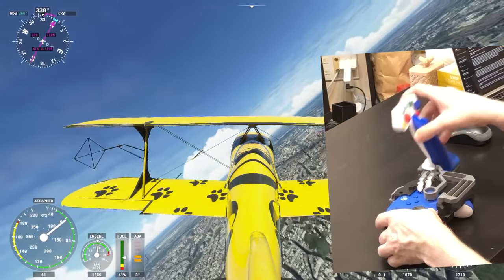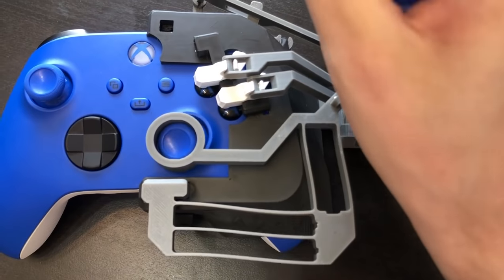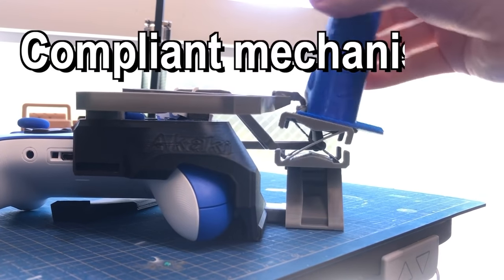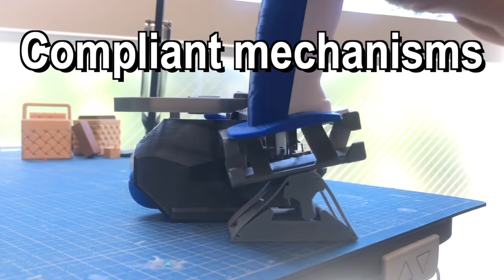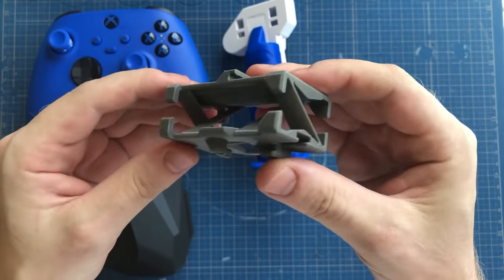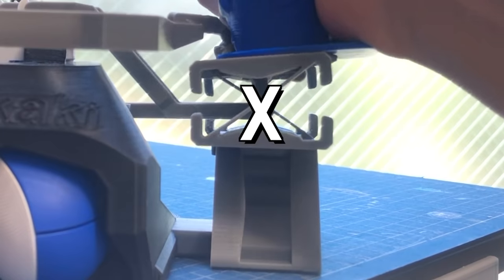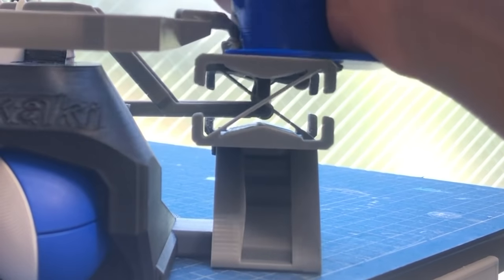What makes this latest design so interesting is that it uses flexure joints. This is a technique we see in 3D printing and laser cutting, similar to living hinges, where you deliberately remove and reinforce material so that it flexes just the way you want. Most notably, you see this here on the base of the joystick where the 3D-printed flexure hinges spring the joystick back into place. You'll also notice how flexure joints translate the joystick movements to the thumbstick — it's pretty slick.